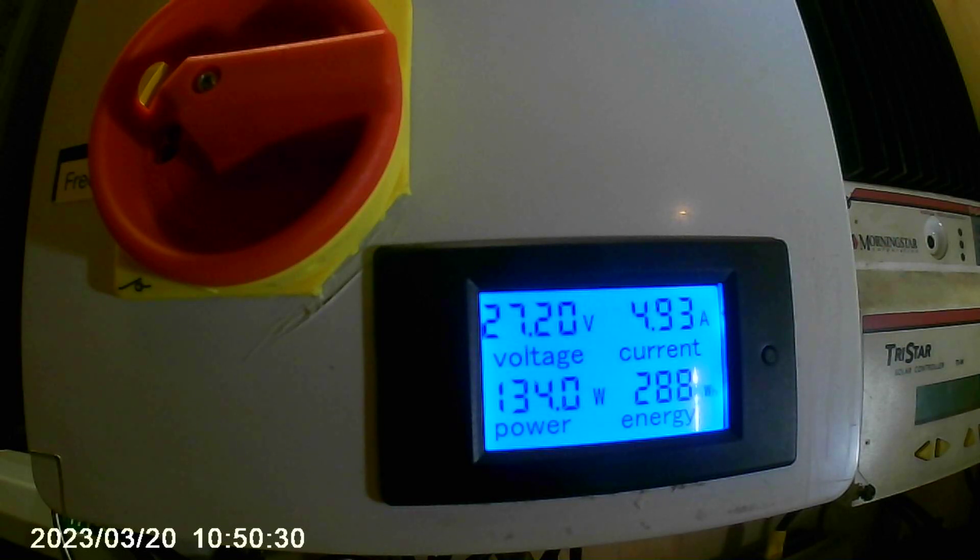There will be a follow-up Part 4 test, but it can only be done accurately with another charge controller — specifically to measure watt hours over time. That would justify why someone would run an over-volted turbine instead of a matched-voltage one. The answer is that in low winds, a matched turbine harvests nothing where the over-volted one should harvest more. I cannot give accurate watt-hour figures right now because they are combined with the solar panel output used to keep the controller active.